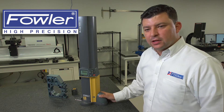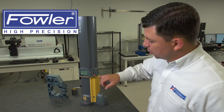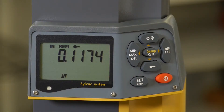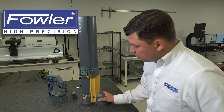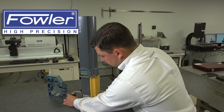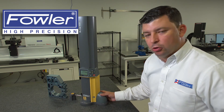After the gauge is initialized, we can then calibrate the probe. We'll drive the carriage vertically, hit the probe button, and the probe icon will appear on the display. At this point, we'll bring our master block into position and drive down to touch vertically on the block until the probe engages.